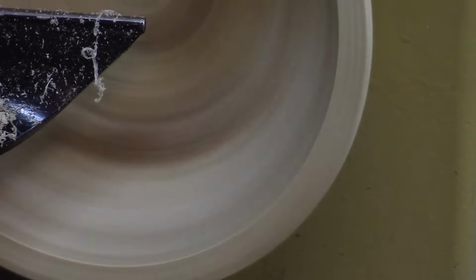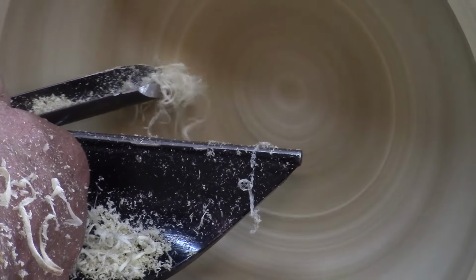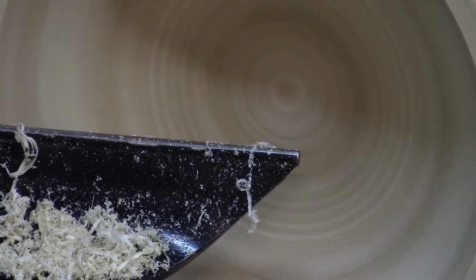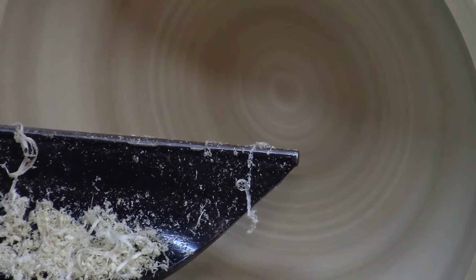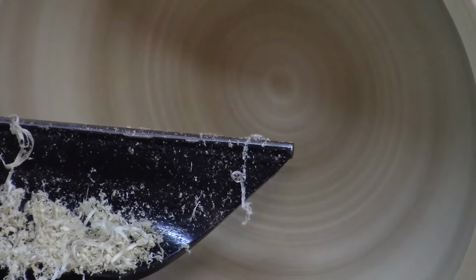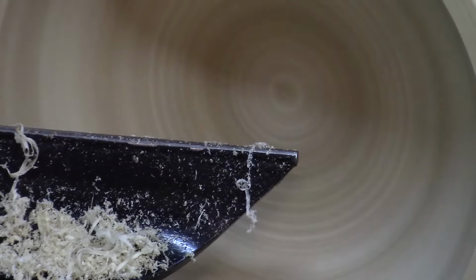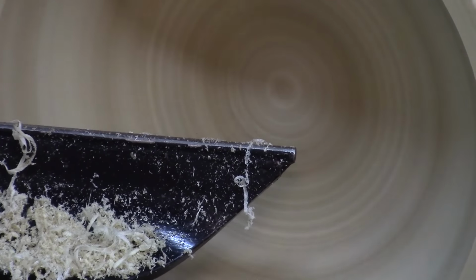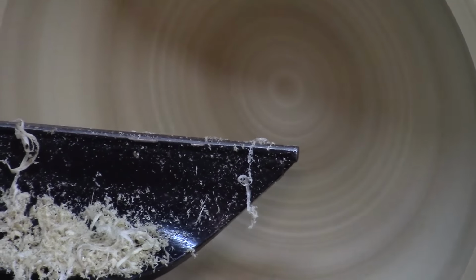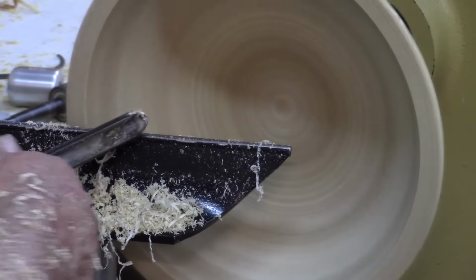And basically, I'm gonna do that left-handed. I might switch gouges here. Yeah, let's switch gouges. So you're using more of the wings of that sharpened edge as opposed to the point? Yeah, and it really has to be sharpened with this jig to get it. And it has to be a parabolic grind. I bruised my rib literally with this gouge sharpened that way because I had a bad catch and it came in here and whacked me. And every so often for about a month, they go. So anyway, I'm going to clean up the bottom using this guy.